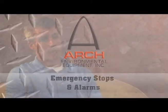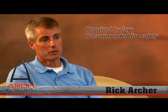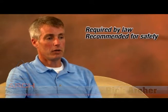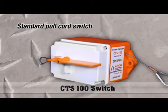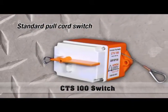Because of the related maintenance personnel that work both on and near conveyors, generally at least emergency stop pull cord switches are either required by law or recommended near the conveyors. We provide a switch that gives personnel the ability to stop the conveyor at any point along that conveyor.